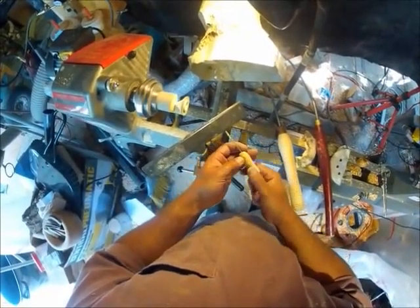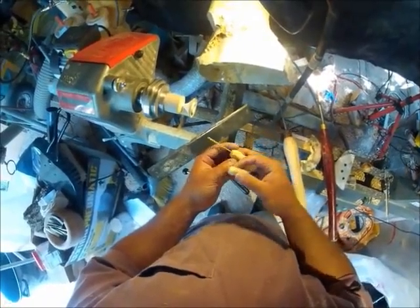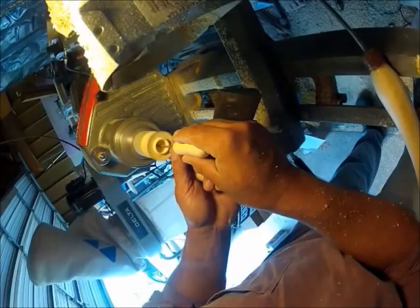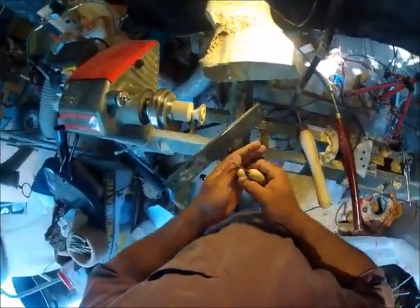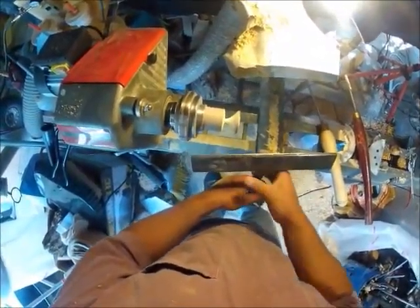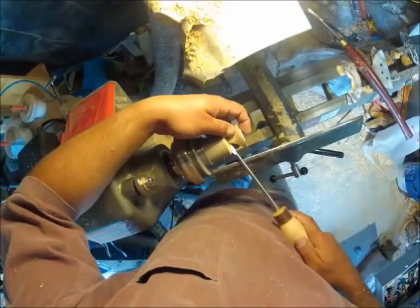I have a 1/32nd and a 1/8th inch drill — they're just on scrap laying around for a little handle. Just hand hold them. A little pilot hole should make this go down pretty much down the center. So we're down the center of that guy. I'm going to just part this off with this little point tool.